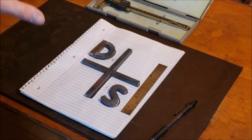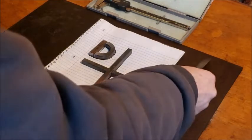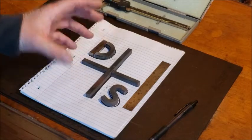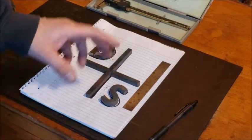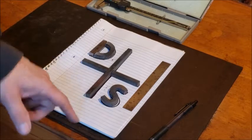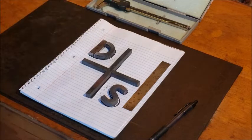It's got to be made out of three-eighths material — that's in the design requirement submitted to the Department of Agriculture. Most letters on a cattle brand are two and a half to three inches long. I shrunk these letters down to about two inches, which is about as small as I can go on three-eighths material and still get it to brand right. You go much smaller than two inches on the lettering and the letters will be really tiny and it'll be just difficult to make letters out of three-eighths material. With spacing requirements factored in, it's just not a very viable design — this brand is already at six inches long keeping it as small as I possibly can.